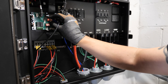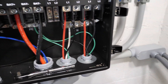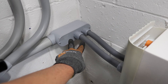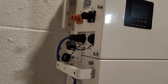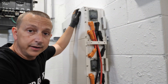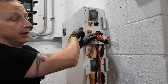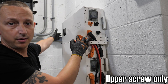Now we disconnect the battery cables and the communication cable. With the battery cables loosened up, I need to disconnect them from the controller box, but first I have to pull out all the flexible conduit. On the left side of the controller box, we disconnect the BMS data cable going down to the first battery. Then we disconnect the Amphenol connectors — the top two go down to the bottom battery, and we disconnect the next two as well since we're removing the controller box.